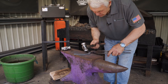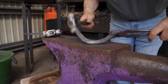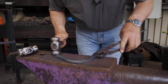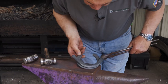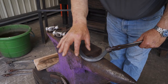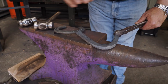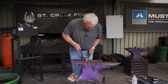Just going around the back with a nice flatten. What we've got is basically the heel is the same as the toe of the equilibrium. Now we just put heels on the end of the branch — similar to a hunter heel, pointed. Then we'll draw the branch and flatten it. We don't want to make the branches too narrow, but we do want to get a little bit more length out of them. I'll forge my heel to center, straight line.